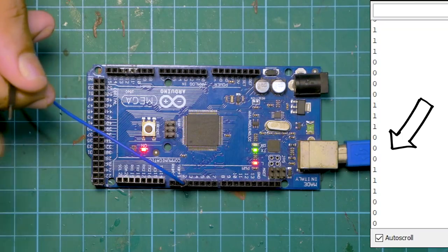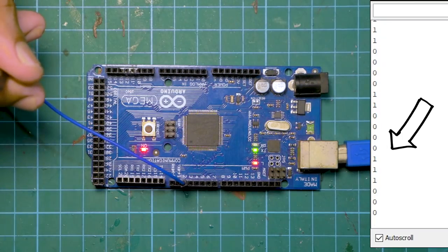This is where the pull-up and pull-down resistor comes in. You might have noticed that the values coming out of the circuits we just talked about aren't very stable. Just by touching the digital pin, we can introduce some fluctuations called digital noise. This is because the pin is in a floating position, and the pull-up or pull-down resistor can actually remedy this.